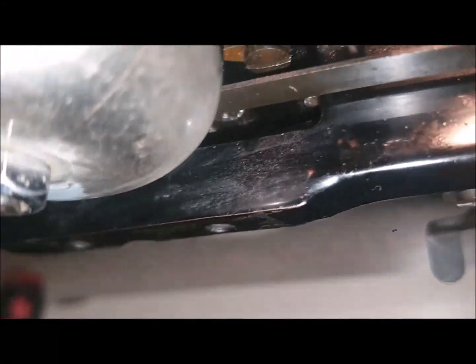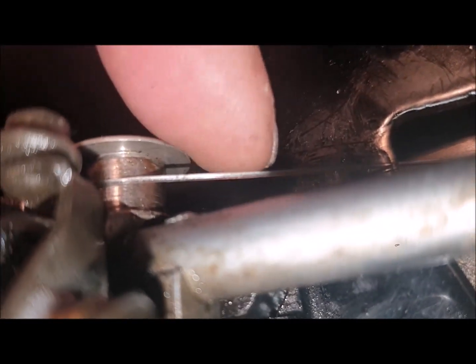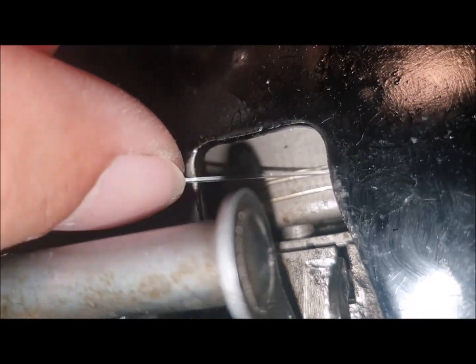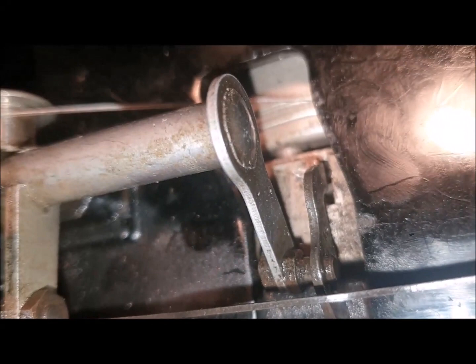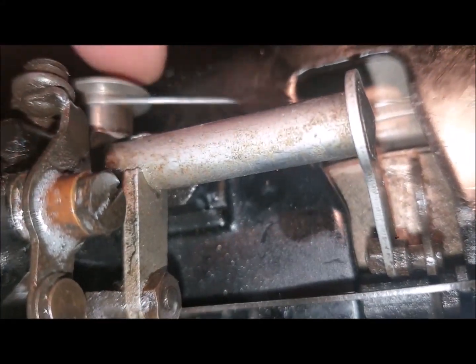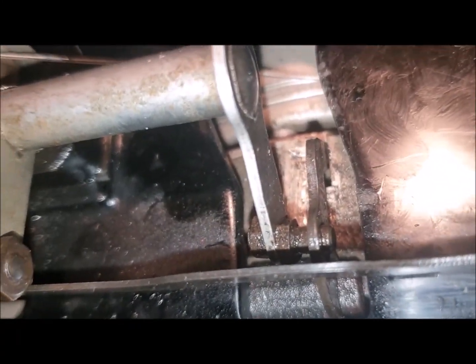Another thing is the actual draw cord is a plate of this size, but I'm using just one fishing wire. So if this moves this way, then there is a gap, right? It gets into this gap. So we need something to hold it like this, then it will be okay. Normally after connecting to the carriage, this part shifts a little to this side, which is not a big problem. But if the mainspring is blocked, then automatically the fishing wire goes this way, so it makes a problem. That's the big job.